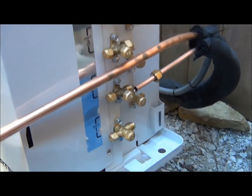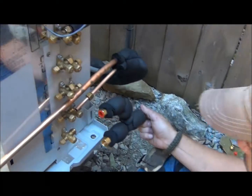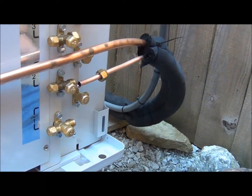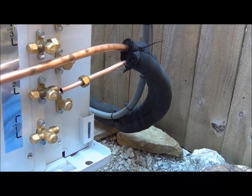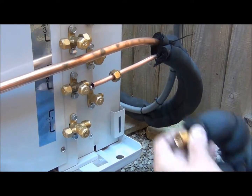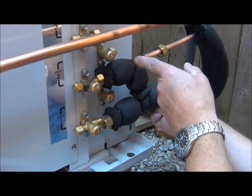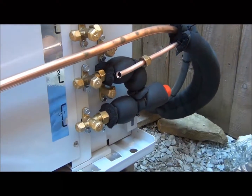Now again, this is a 30-36, so we have a U-shaped bracket that we're going to be putting on now. We're going to take up two of the ports — the 3/8 inch suction ports, or the wide tube side. They call them wide tube and narrow tube. We're going to take up two of these ports, and there's a 5/8 inch adapter on the other end. So we'll have a 5/8 inch wide tube and a 3/8 inch narrow tube.